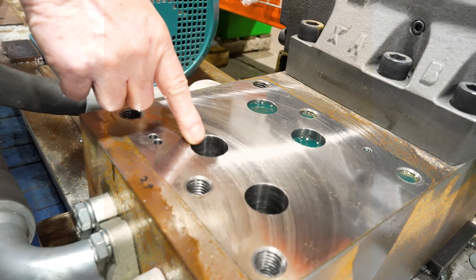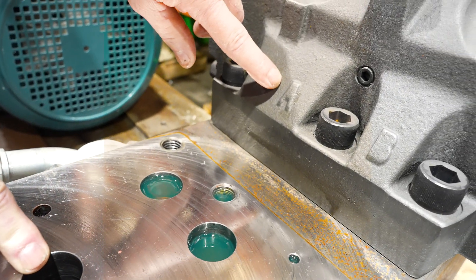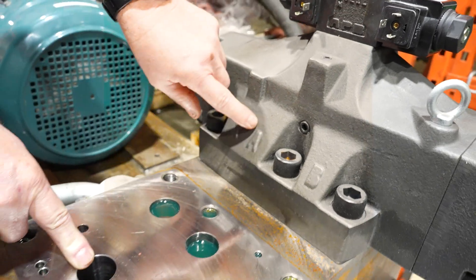And is that a good thing? Yes. This is the pressure port in. If we look at the valve - he only took one valve off - P is coming into A. So that's not good.